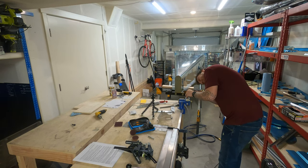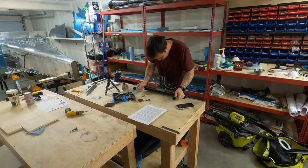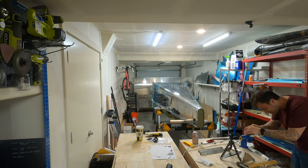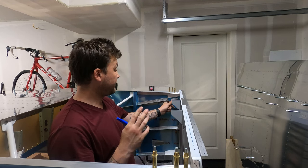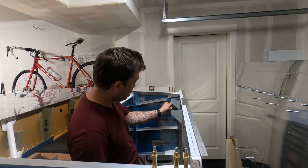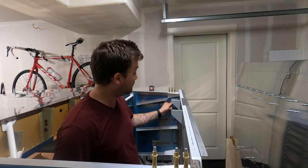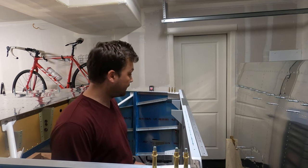Left to right the cuts are exactly the same — it's just the bends that we're gonna have to change. So I'm gonna make all the same marks, drill the holes, and at that point bending up becomes down and down becomes up. Adjustments are the name of the game here. The part number begins with a six — to me that automatically means it's gonna take some fine-tuning. The instructions also note that it's gonna take some fine-tuning, and indeed it does. I've grown a little tired of walking back and forth, so I simply measured this one. I know what my edge distance needs to be and I put a line here on where the bracket needs to go. I could use about another thirty-second, so I'll take a little more off, do a double check using the same measurements and technique, and then I think we can drill them in place.